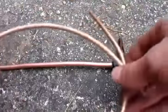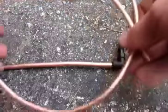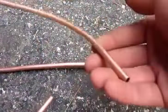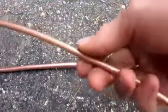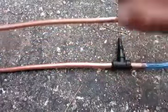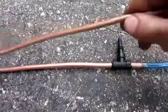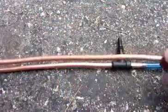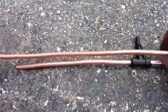Just a little pro tip: when using these, you obviously have the option for a flathead screwdriver or the hexagonal nut on the outside, and I always opt for the nut because you can torque it down a lot easier, it's not going to fall off, and when you torque it up nice and tight the body of your gun is not coming loose. The next step is to make your barrel, and this is a multi-step process. The main portion of the barrel is made out of this copper piping. First, you want to bend it as straight as possible — and you may be thinking how inefficient it is if it has a little bend — but because we're using a ball rather than a pellet, they actually roll down these barrels very easily. All you have to do is clean up the ends when you cut them. First things first, measure out your barrel, and go ahead and take it off with a saw.